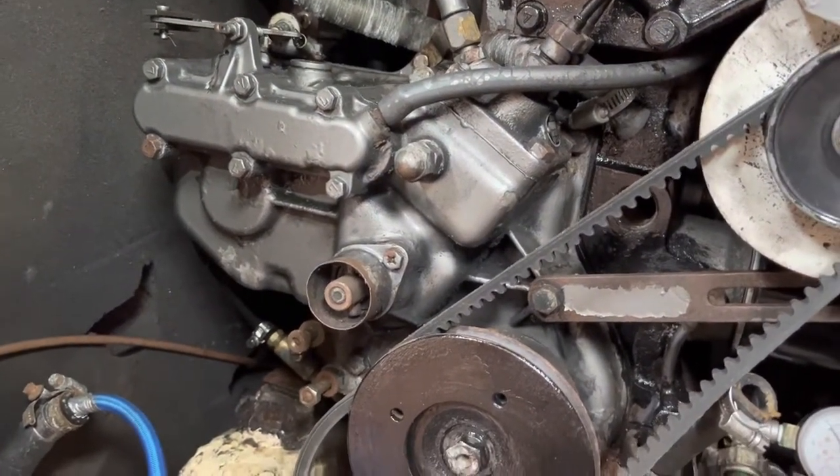It's time to start putting things back together as parts come in — rear zinc anode. Still can't get it out. I even climbed up on top of the engine with a spanner to reach the rear and really got into it. The next part is there's some casing behind it; those bolts generally tend to be greased so they'll be easier to get going. There's an electrical fitting on the end of it which I guess is the heat alarm or overheating alarm. I'm going to go back, do a bit of reading, and see what's likely to happen when I pull that off.